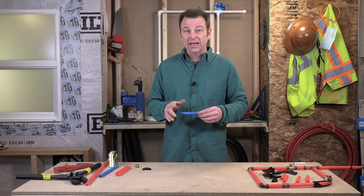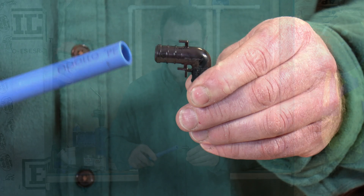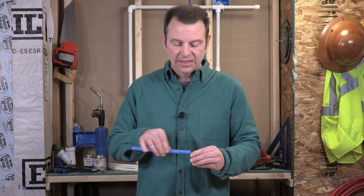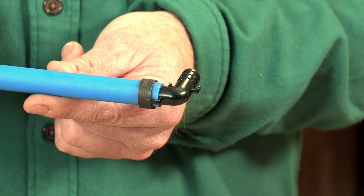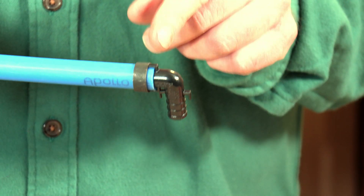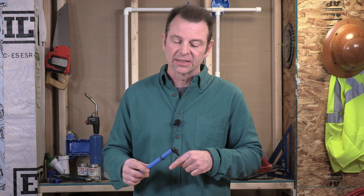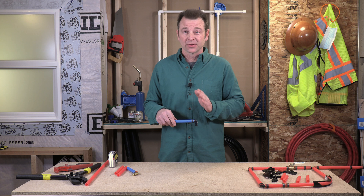I have a variation of this in our plastic pipe. This plastic pipe has some standoffs — these little plastic standoffs — and when I push my pipe in, it not only works to stop my pipe but it will also take a standard PEX ring. As you can see, those little standoffs will hold that ring off of the end of the pipe. The downside of this particular fitting though is that it does not hold the ring in place like my pro crimp ring does. So make sure that you're very aware of where that ring sits at the moment that you're getting ready to crimp it.